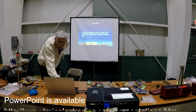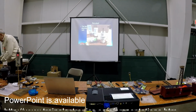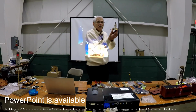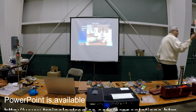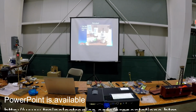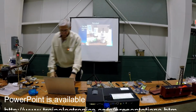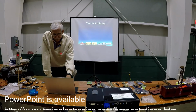All right, the latest version, let me pass this one around. If you don't have a pill bottle, this is just, well, you know what that is, hardware store PVC pipe fittings. And there's 3 of them there. So you can make it out of pipe fittings as well. Bottom chamber gets pressurized. In between the 2 chambers is the heater. Top chamber is where the smoke is generated. And there's a video also on YouTube on how to make it.